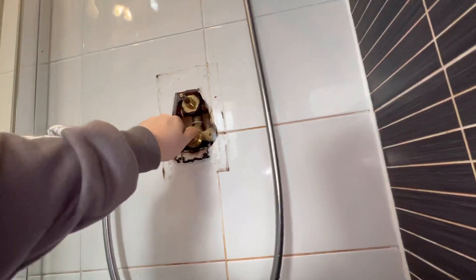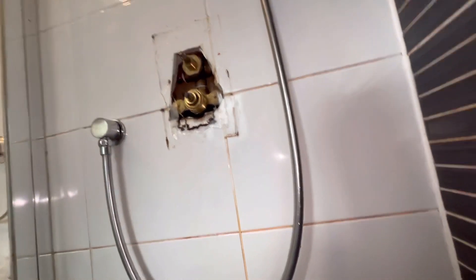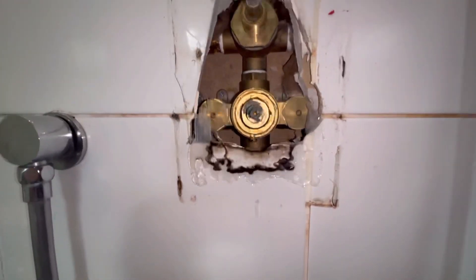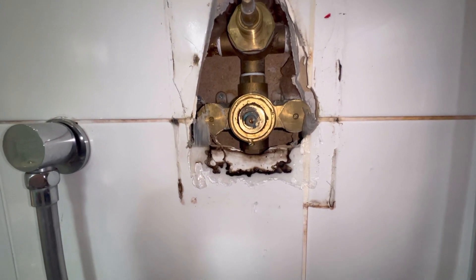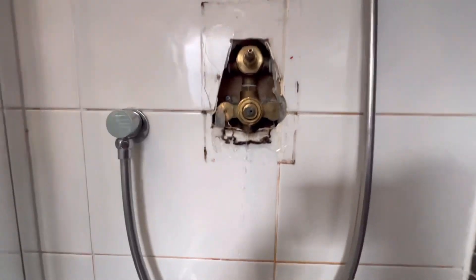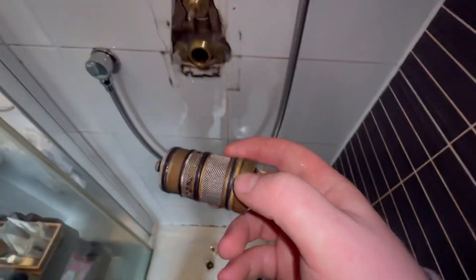What I'm going to do is slightly crack the cartridge and leave it open so the water drips out the leg. Because it will not be the first time I've fully pulled the cartridge out and thought, why did I just do that — because it's been on a pumped system and it's blown everywhere. And those are just some of the harsh life lessons you learn as a plumber, because it makes you a better one and gets you prepared.